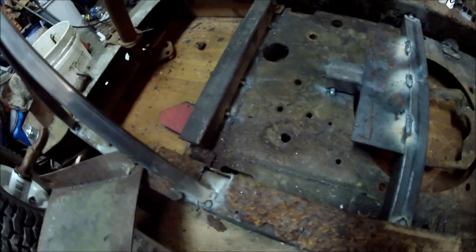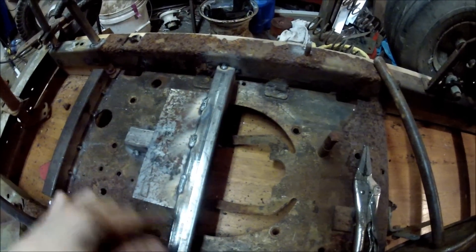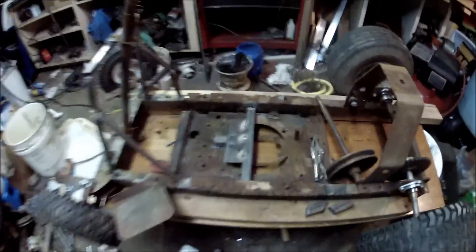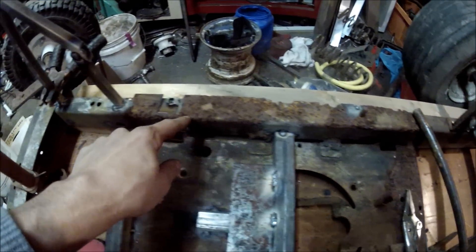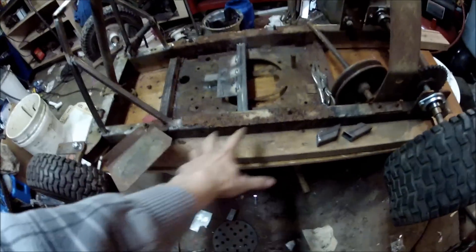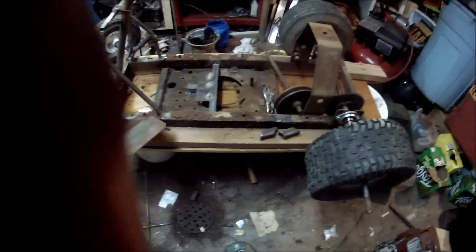Here's what I've got for the motor mounts. I'm going to drill the two front bolts, and then I have this cross piece with a piece of flat stock on it, and another piece of one inch square tubing welded on the back side under this. It's only about 16th inch thick, but it's not very much of a motor and it's reinforced. I'm still going to cut this bolt off, cut these brackets off, and I'm probably going to cut along the edge on both sides just to make it look nice. I'm going to end up putting Nerf bars on it.